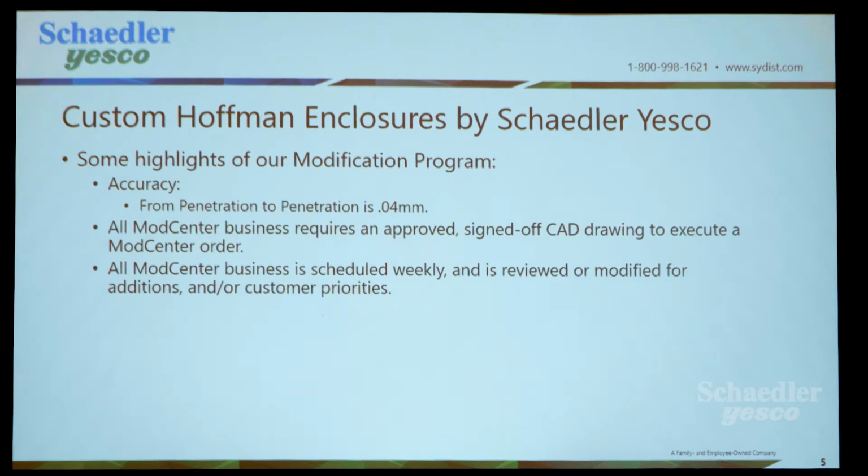Accuracy. I'm always asked about accuracy. There's two things really when you're talking about the Mod Center and cutting: accuracy and repeatability. The accuracy is 0.04 of a millimeter, so it's pretty close. And actually, it's hard to even get better than that because if you look at the edge of the enclosure, the edge of the enclosure is not any more accurate than that. So to try to get better than that, it's not going to happen.